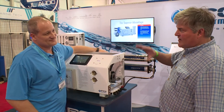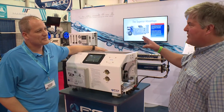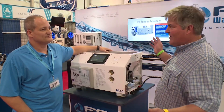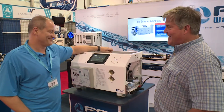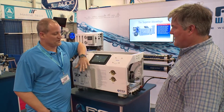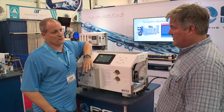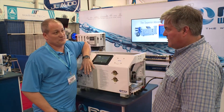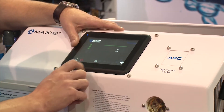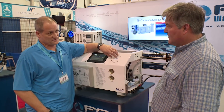The other thing I hear is the difference between manual and automatic. I love the idea of automatic, but the concern is that you've got this expensive I/O card — you're in Vietnam and it goes out, there's no way you're getting it replaced and you don't have water. We're the only manufacturer in the industry that has an ABS certification on our electronics. Everything in our unit is marine grade, meant for a marine environment. If something did break, you can lock out the electronics on our automatic pressure control unit and it can become a manual unit. And if you did have a problem anywhere in the world, we have distributors and dealers worldwide for service.